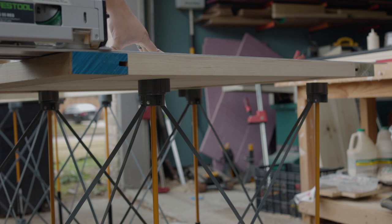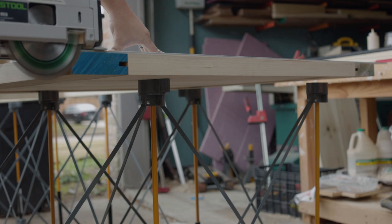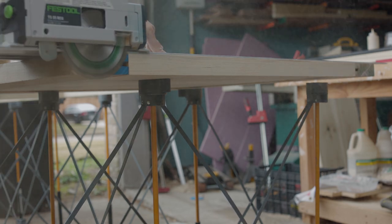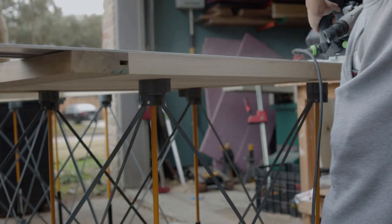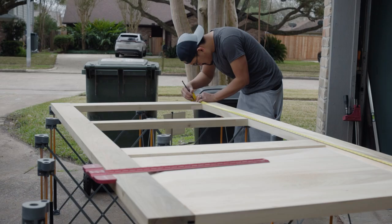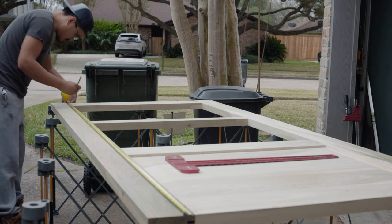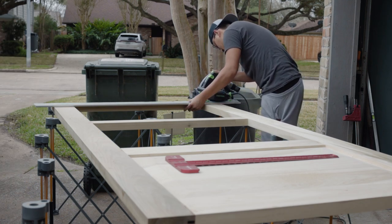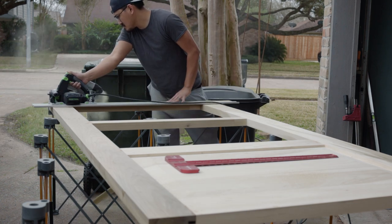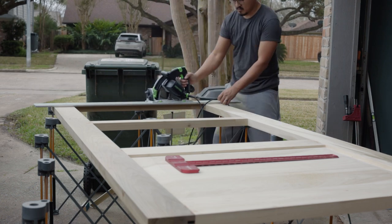I made the doors taller than needed so I could flush off the top and bottom edge with my track saw — taking off just enough so that if I needed to remove more during install, maybe because the floor at the client's house isn't exactly flat or I might need to raise the track a little bit, there'd be some room to accommodate surprises during install. Once I got the doors flushed, I went ahead and installed the pulls. I went with recessed pulls, which needed a small pocket to be routed out — that was easily done with my trim router.